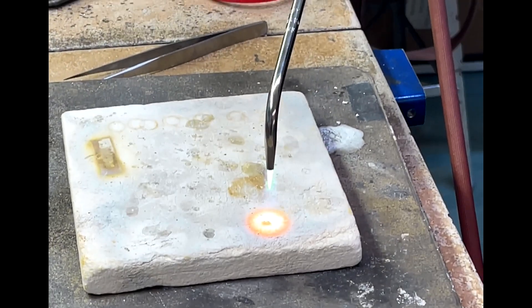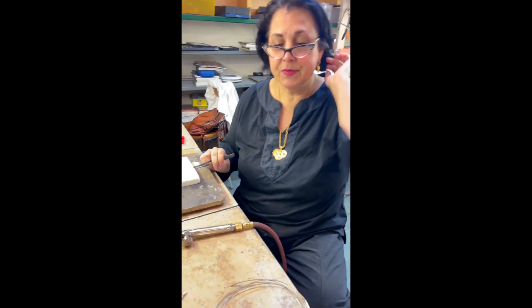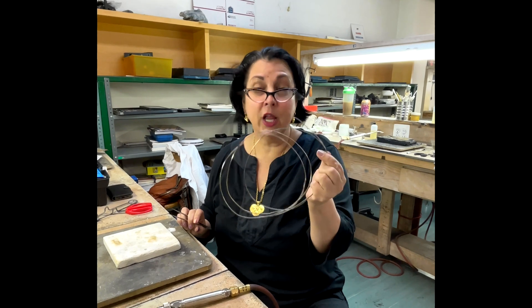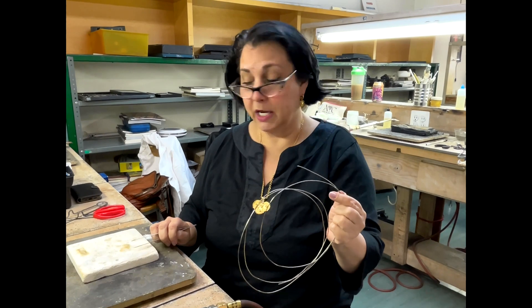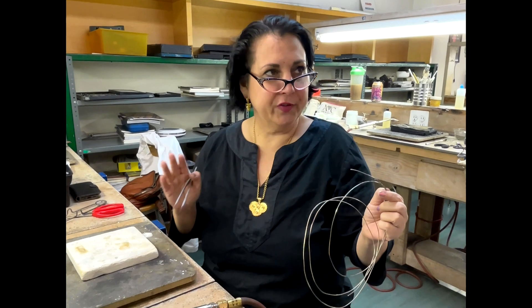Okay, just like you're melting a solder ball or whatever. Now you see that white, shiny — that's fine silver. Fine silver is just pure silver; there's no copper in it to oxidize. However, there is sulfur in the air, so fine silver that's been left sitting in a drawer for a long time can look like this. And if you just looked at it and said oh, it must be sterling, you would be wrong, because when you melt it you'll see what it really is.